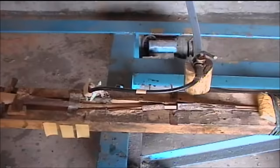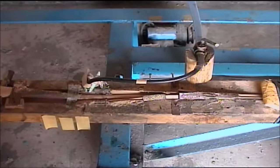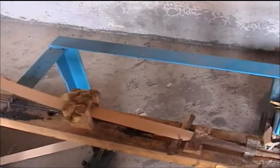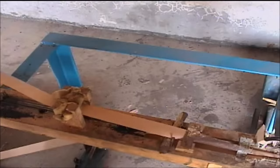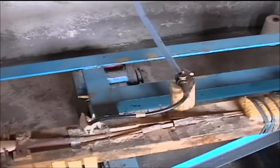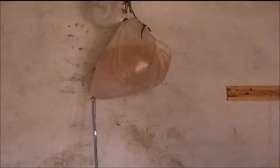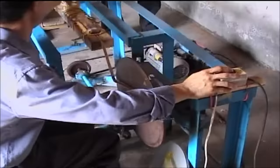The Quick Match sleeve is formed from two paper strips as they are folded by metal guide brackets around the strings. A small amount of glue dispensed from a bag suspended nearby is applied to one edge of the top paper strip. The glue will hold the folded paper together as it is flattened and creased before being wound up on a large reel.